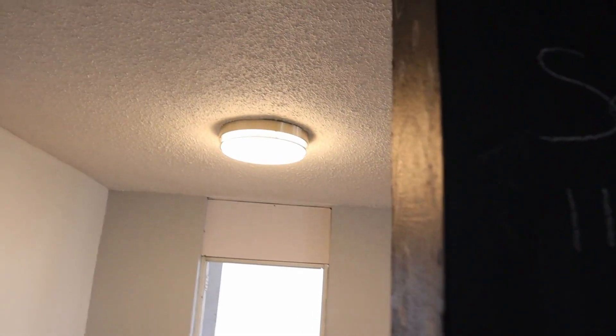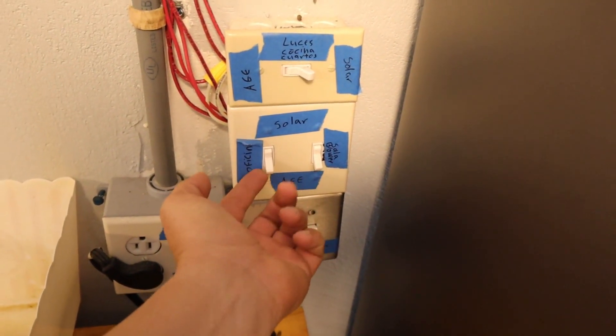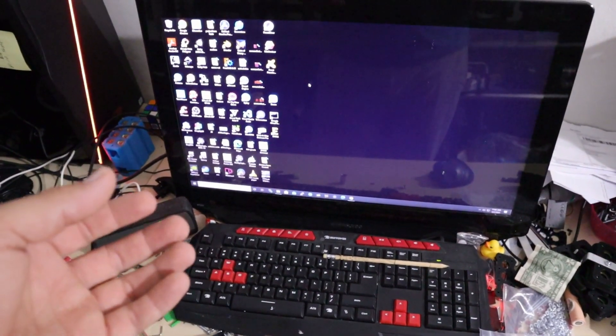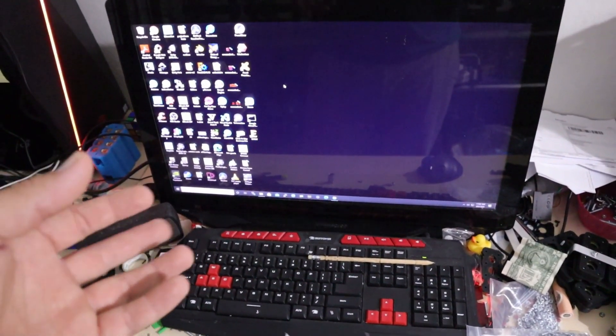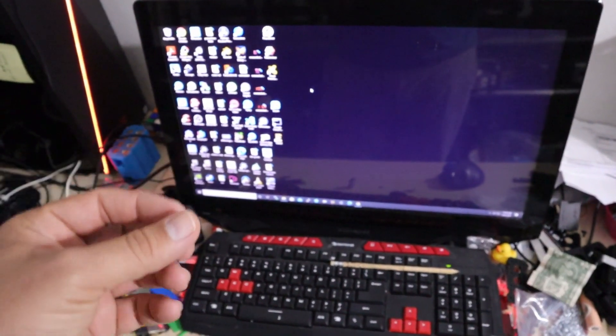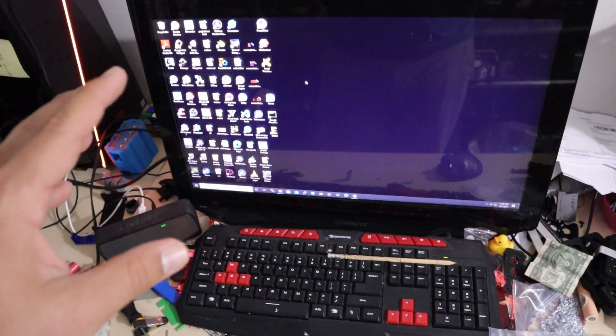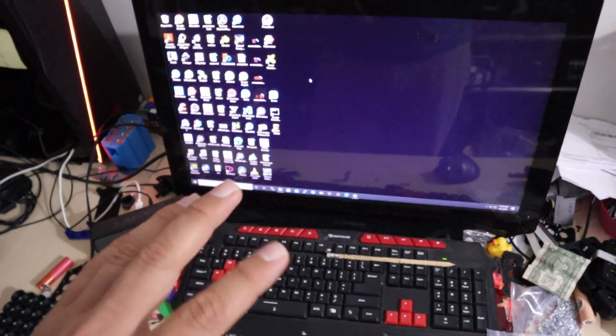As you can see, that's the light from solar — just turn on, turn off. I'll leave it on for now. My fridge is currently working with the grid — we're going to switch it. There you go, we still have power. And the last two is going to be my office where I have my computer on right now. As you can see we are running off the battery, and this is the importance of why I wanted to change the inverter. The old inverter was not a pure sine wave — it made a ticking noise, a static noise. And as you can hear right now, there's nothing. Just the fact that I can work now even if there's a blackout is just amazing.